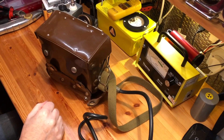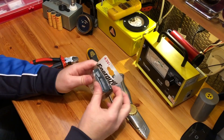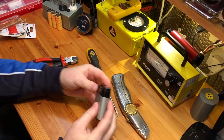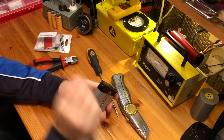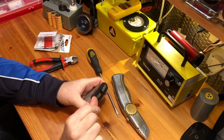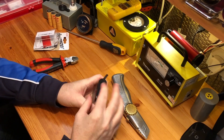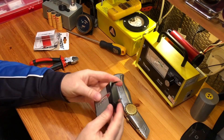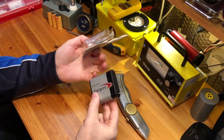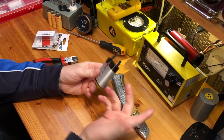Right, we'll go to opening up the LR12 battery pack so you can see what it looks like. You're going to need a couple of tools for this, although the plastic is reasonably easy to get into. I've literally just taken it out of the box, pushed it with my finger, and I'm able to take off the top. There is no glue — just a little clip. Get your fingernail underneath the corner or use a screwdriver to lift off the cover. Now these two terminals at the top — this is a lantern battery. Some old torches use these. As I said, it's called an LR12, 4.5 volt. You'll get one for about £4.99 on Amazon, probably cheaper on eBay.